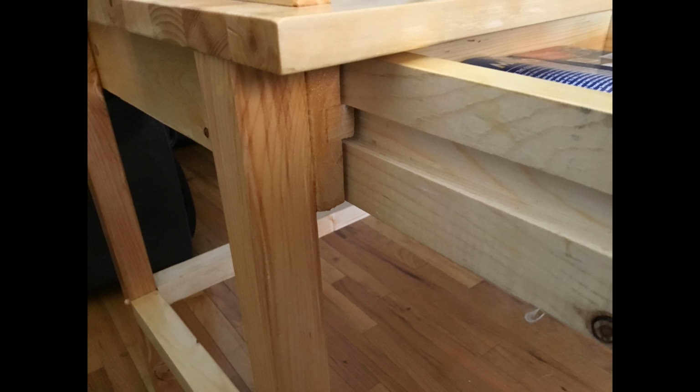There again is a good look at the drawer in function with that drawer glide, that 3/4. So you have the dado that's up, almost a half, not quite a half inch, but you've got 3/8 sticking out both sides, and of course the width of your drawer is a little lighter than that, so you have plenty of room. And it's a very smooth functioning way of working a drawer in your desk.